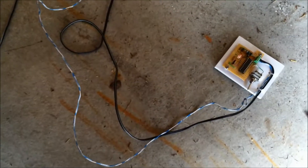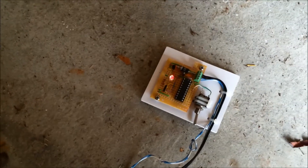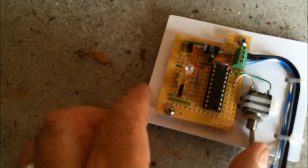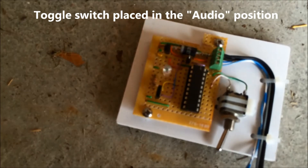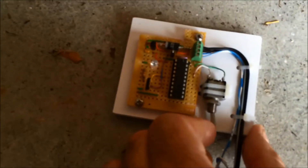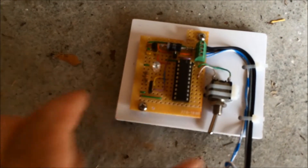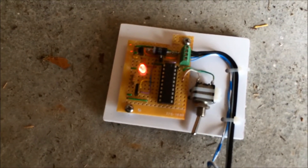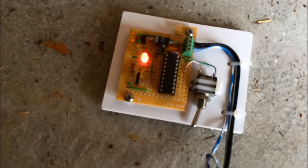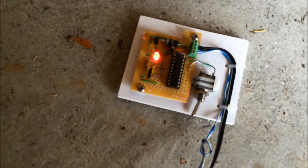Once we've located the wires and the route the wires are taking, we're pretty confident we know where the wires are going. This has been the mode we've been operating in with the toggle switch — the light was flashing rapidly. If we flip that toggle switch, you'll see it now starts flashing about two and a half times a second — that's the chatter mode. This was the wire tracking mode, and this is going to be our chatter mode or the acoustic mode. We're actually going to try to see if we can hear that valve shifting — right now we're trying to shift that valve two and a half times a second. It almost sounds like a heartbeat when you hear the valve shifting at that rate.